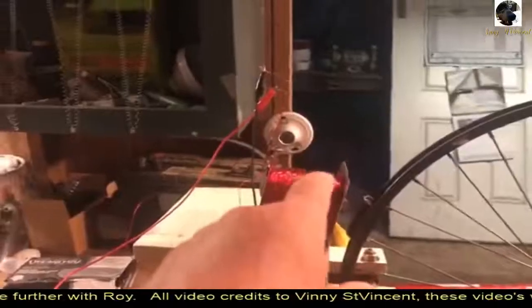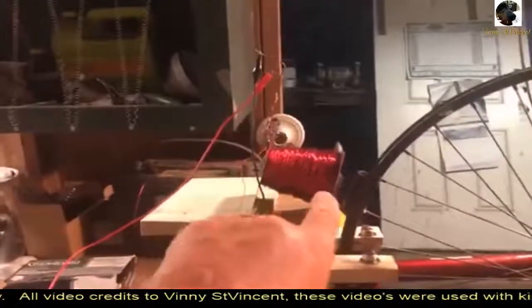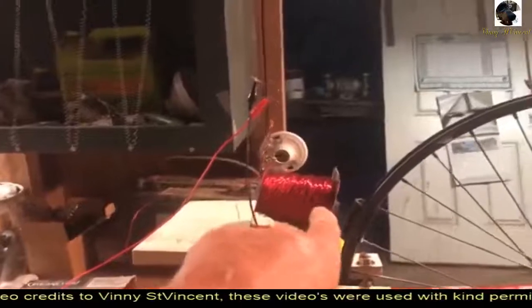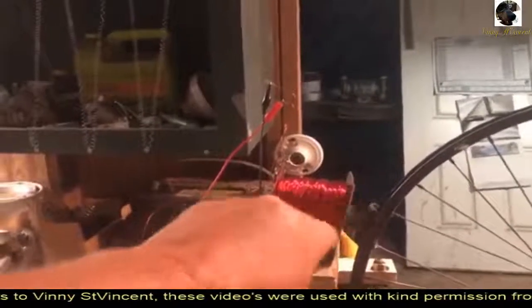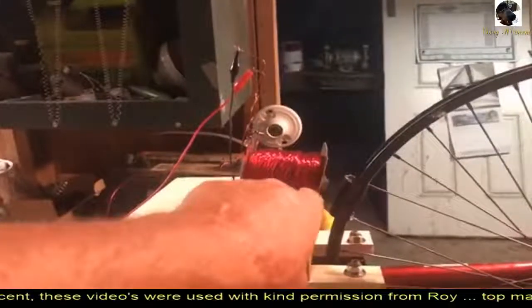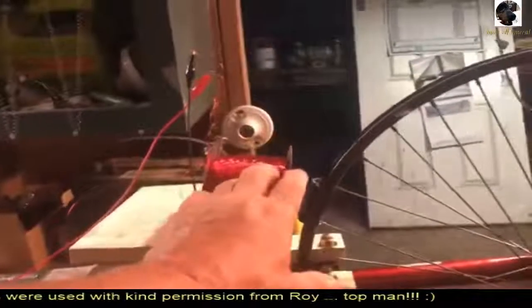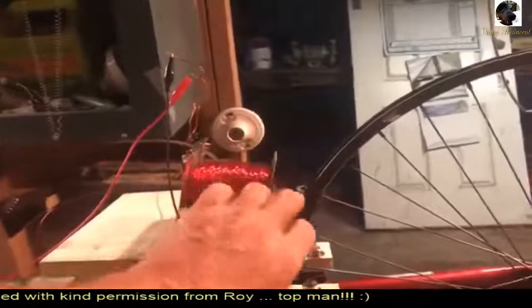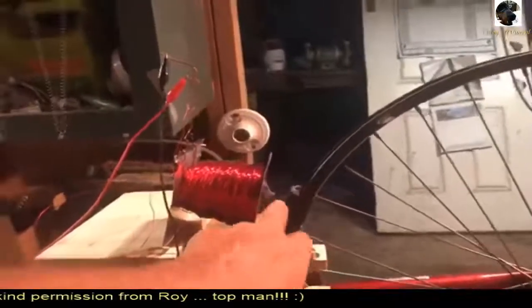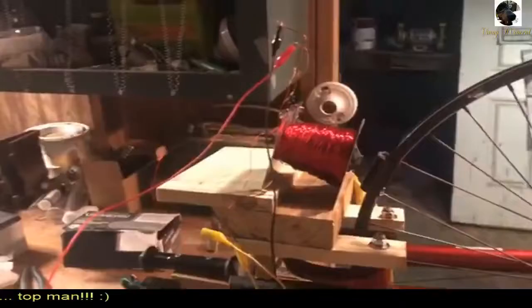On this coil here, coil 1, the prime mover is 16 gauge wire. I wound it first, but I did wind these conical. So if you see how they're fatter on one end and narrower on the other, it is because I made one complete winding and back, and then I continued to wind the primary, or the prime mover coil, 16 gauge wire. So it's concentrated in the front here, and coned down. And that was so I have a stronger magnetic field towards the end of this laminated bar, and that's 300 turns. And then I have 22 gauge wire, and I have 1200 turns.